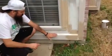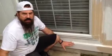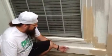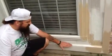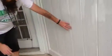Here's this beveled edge here. This siding was rotted all the way around this patio area. You can see we put a 1x6 on here — it's a nice thick 1-inch wood. It's got a beveled edge on the top so that the water drips off and it doesn't rot the wood or the siding.